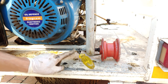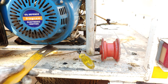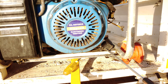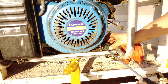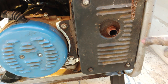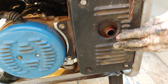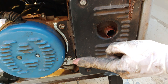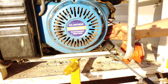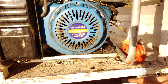Tighten the nuts fairly tight as they sustain quite a lot of vibration. Just before you fully tighten the bottom nut, note there are different slots — not all generators have this, but this one does, giving you an alignment option for where you want the engine to sit. That little wedge has to get into the correct hole. Check the exhaust — it should be sitting in the middle of the frame. If it's pushed too far to one side, the mountings need realigning: release the front or back mounting slightly to shift the engine. You want the generator to sit equidistant on the frame.